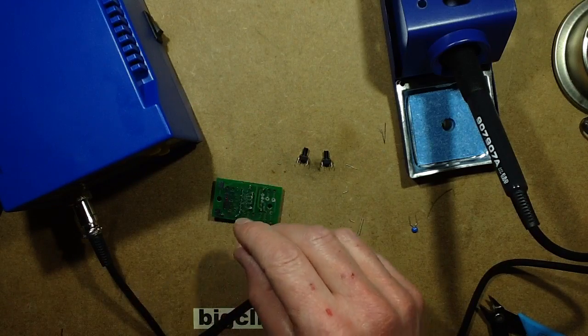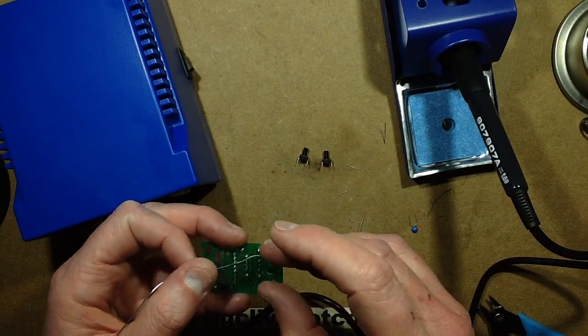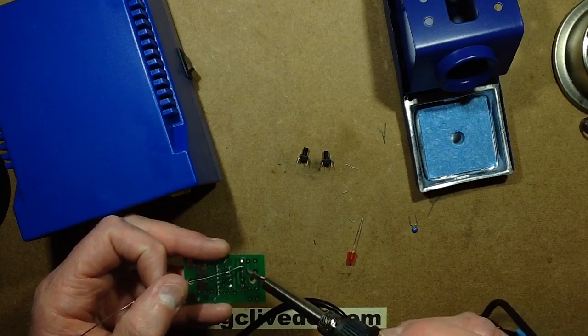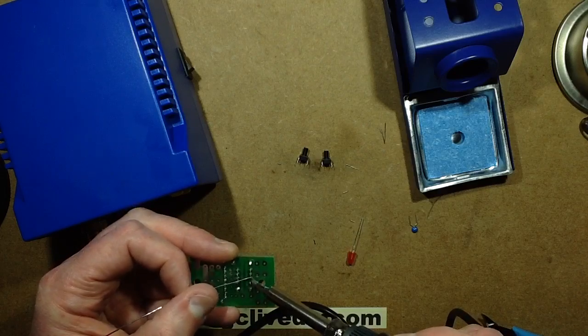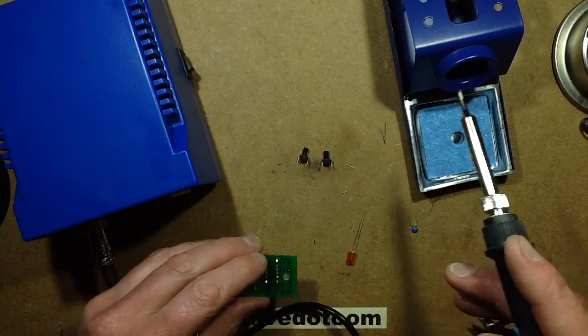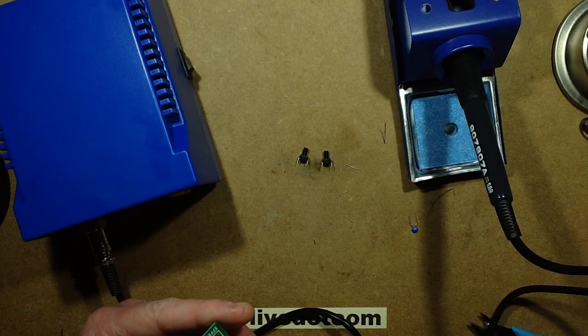It's a neat solution. The downside of this one is that if it ever goes wrong electronically, like the little processor fails or stuff like that, it may not be repairable. That processor is not something you could just reprogram without the correct software, and it would be quite hard to solder in because it's a little surface mount thing. So that makes it less repairable.